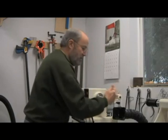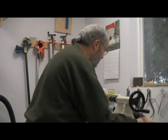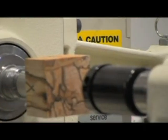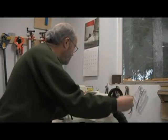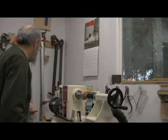That's a nice tight fit. Then we'll bring the tailstock up for additional support, and I'll use the same little piece of wood as a buffer. But first I want to make a little hole in this end just to mark the very center, because a hole will get drilled there for the salt to come out, and then a series of holes around it. Doing it on the lathe is probably the most accurate and easiest way. Now I'll put the little piece of wood on, rotate it to get it centered, tighten it down, and install my tool rest.